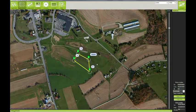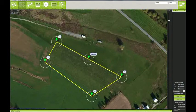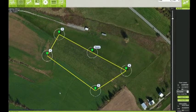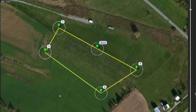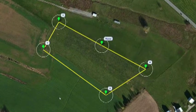One of the first things you'll do is go to the Flight Planner page — this is where you set your waypoints. After choosing your flight location on the map, you'll set the home point and then add waypoints. Waypoint details can include altitude, speed, and some specific actions such as loiter for a given number of turns around that particular waypoint. The pattern example I entered here is quite simple and will result in the plane flying to each of the four waypoints in turn and then circling over the home point until I take manual control or tell the plane to do something different from the laptop via the telemetry radio.